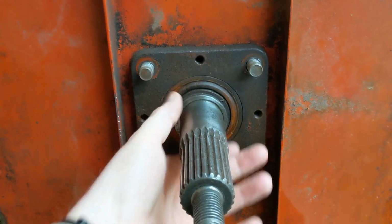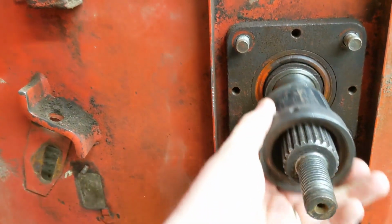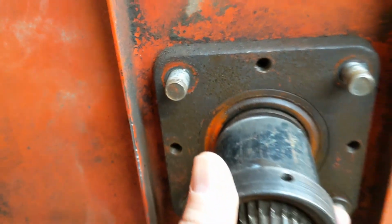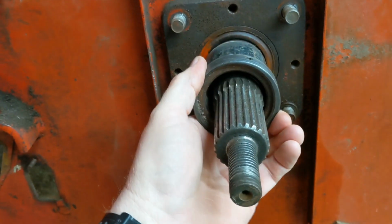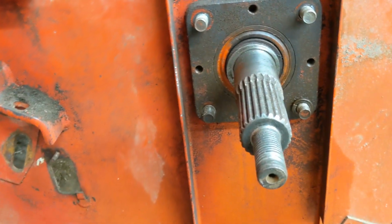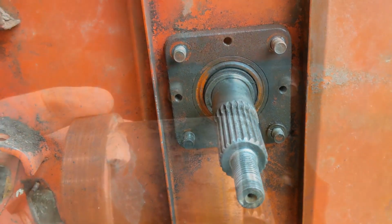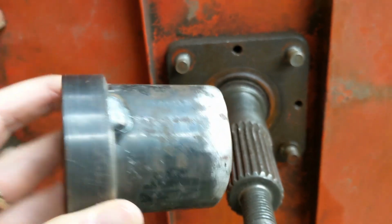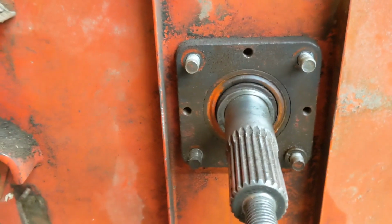and we're going to weld this fitting that we made to the bearing. This pipe actually kind of goes over the race. I think the extra heat helps, directed right on the race. Then we get our puller on there and pull it off, and we're not reusing the bearing anyway. Bearing off, you have to take a cutting wheel and retrieve this piece, so it gets shorter and shorter over time, but you can just make another one. It's not hard.